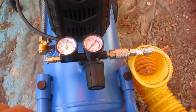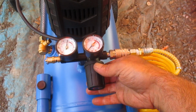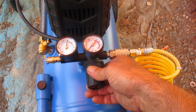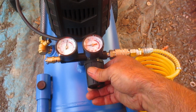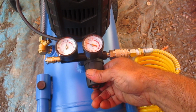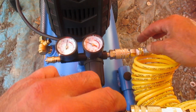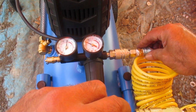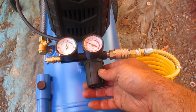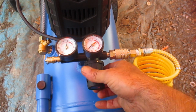And to put pressure on this chuck, we now can operate this clockwise, and we should see pressure coming out there. So, reading the gauge, I get about 75 psi on that now, and this is what I was talking about. Even just putting that on hand tight, there's no leak there. I will tighten that up a little bit though. And release the pressure counterclockwise.